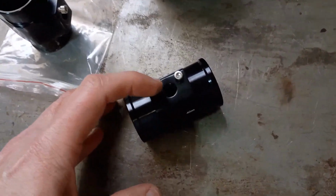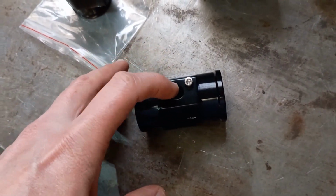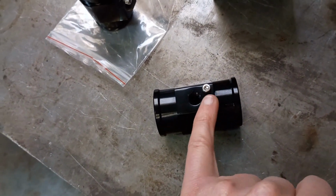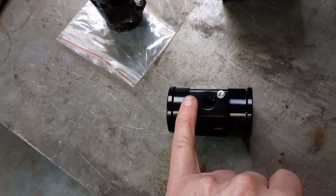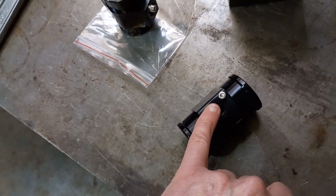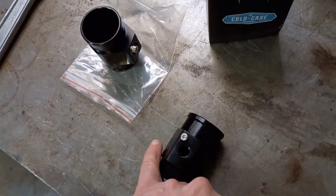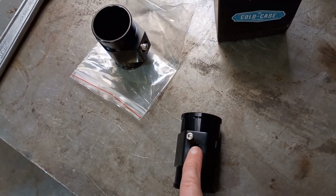What I do is I take a 1/2 inch 2-flute end mill and plunge it, not centered, but offset away from this lug a little bit. That way we've got the meat over here for a ground lug. We want to remove from this side, but obviously you don't want to go too far over, because if you leave any of these threads right there, it's just going to leak. So you definitely want to take the threads off of that wall closest to the ground lug.